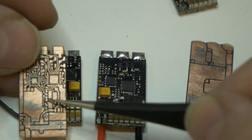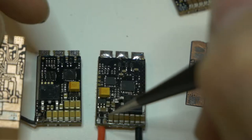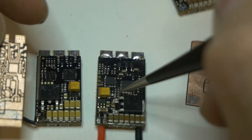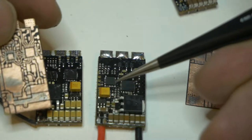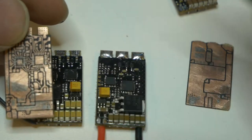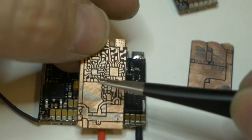So then my next thought is, okay, if I cannot figure out which one of these resistors the signal wire goes to, because on this one the pad is ripped off, and I already tried jabbing it down into the via there, and I can't get a hold of anything. And on top of it, how would you know if you did or not, if you're on the right resistor or not, or if you're in the right via, or if you're all the way in the via? And so what I thought was, okay, on the known good one, where do things go next? And then maybe I can correlate that to this. So, bring this back in frame.